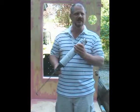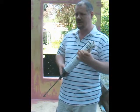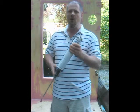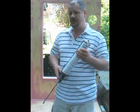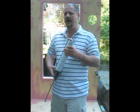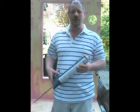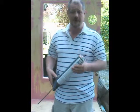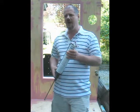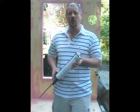A window sill would obviously meet that criteria. It's not that they're expecting liquid water to get through a membrane or a product that is vapor-open — Mother Nature is a powerful force and always wants to be in equilibrium. The concern is that there's a vapor drive through that material that is then aided along by the capillary action of whatever the substrate is. In this case, it would be plywood and 2x4s.